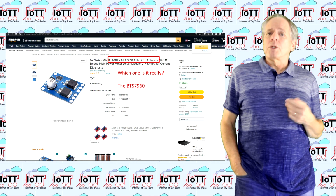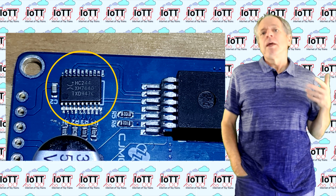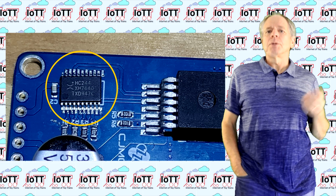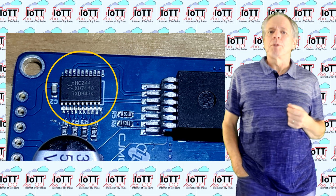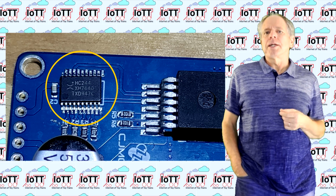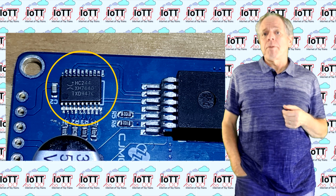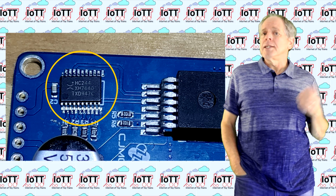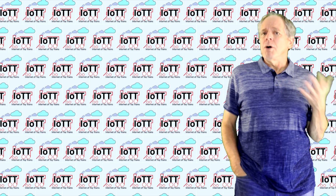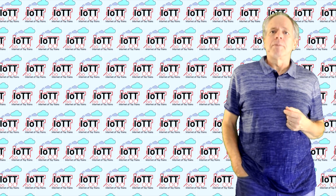And if you order these boards, make sure to inspect them before use. From the two modules I ordered, one had the controller chip misaligned by one pin. I placed a customer complaint and received a replacement board. When I tested them, only one of the boards was working, the other was dead. I then touched all the driver and controller chip pins with a soldering iron and that did the trick. Apparently a soldering problem, but it suggests that these modules were never factory tested, so be careful before using them.